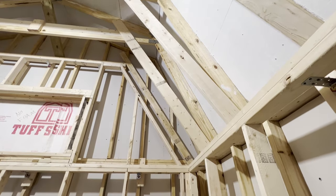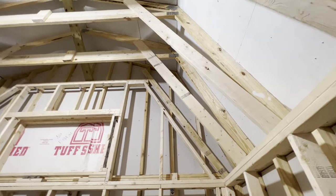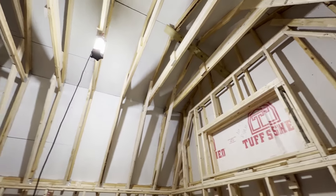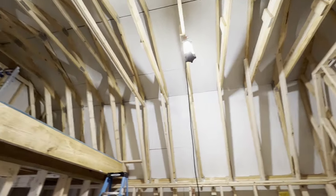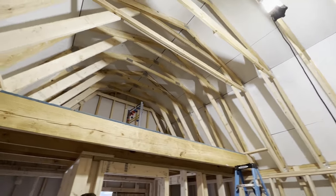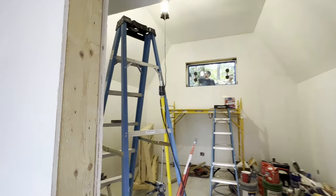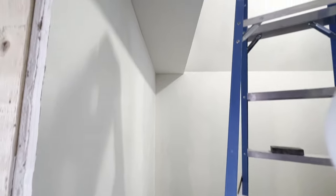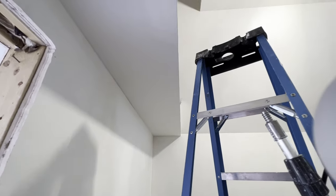So what we did was beef up the inside of those exterior walls with five-eighths inch drywall in all the bays of the project — it actually helped out a lot, adding mass to that exterior wall. Then we put two layers of five-eighths inch drywall on the interior wall, kind of like having two similar-mass walls side by side.